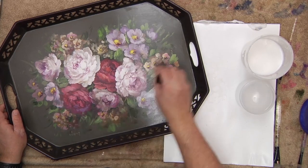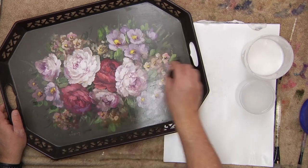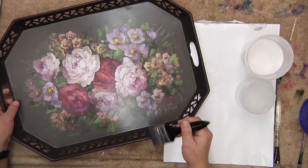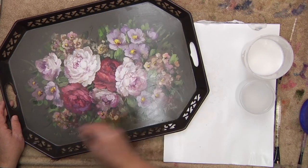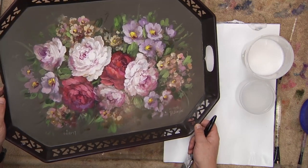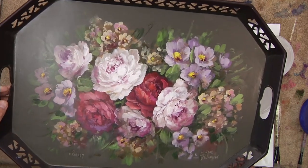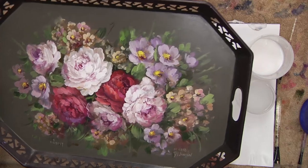This is such great varnish. And you put it in conjunction with this super, super soft varnish brush like this. And even though this is a little sticky and tacky, I can go right over it with my brush and not hurt the varnish whatsoever. And you can see I get a beautiful varnish coat down on the whole thing there. And you can see there's no brush marks anywhere in that surface. See the glare. Watch the glare. There's no brush marks anywhere in that surface. There's no beading up at any time. Everything came down flat, and the coat is absolutely perfect.